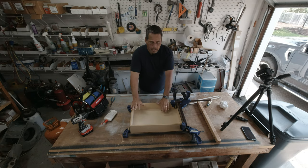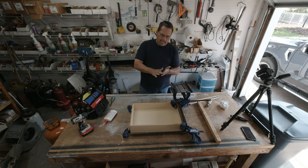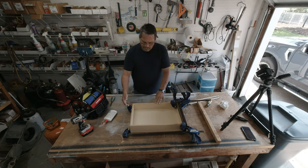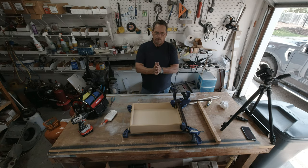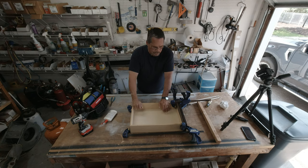There are drawer boxes that we do have in stock, but the problem is we get them from HD Supply and they just make quick boxes — stapled from the outside in, not really mortised, not glued. So it doesn't take much for that panel to pop off. I'm not really wild about those. Anytime I get one, what I do is take them apart, sand the edges because it's some kind of polished wood, then put a line of glue on both sides, go ahead and put the staples back in. That glue gives me double support for holding that panel in. We could put another box on it, but they're usually not as good as the originals.